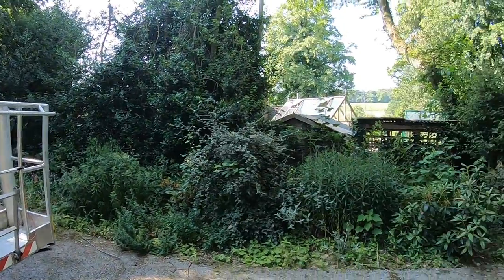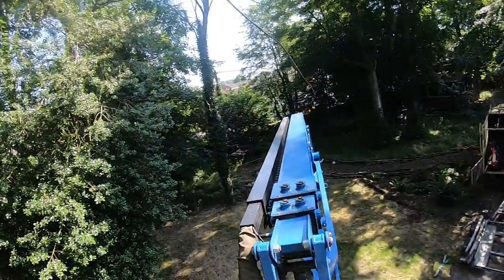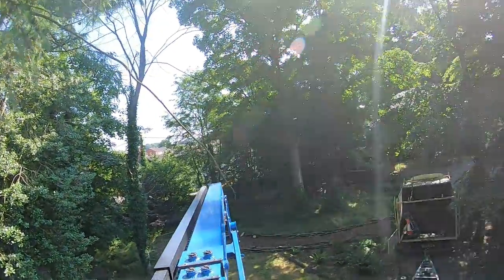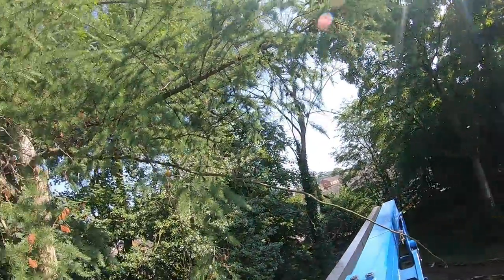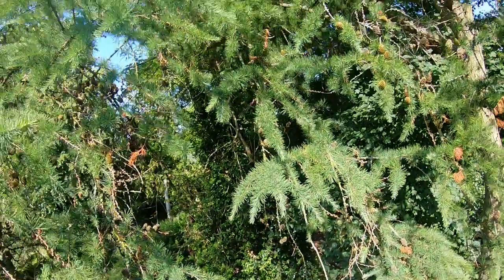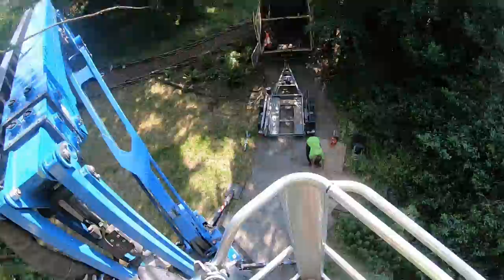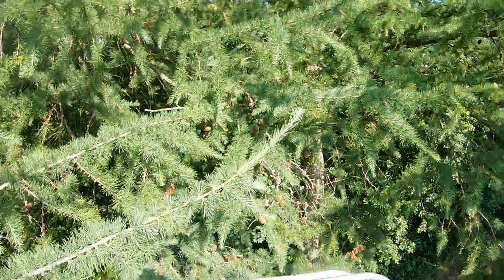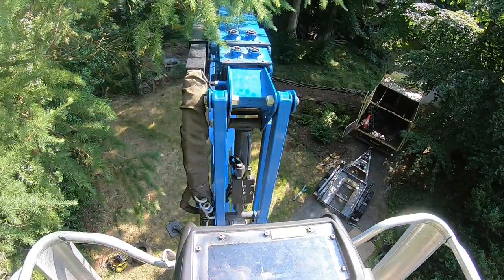Be sweet. So with a MEWP, you want to remember an acronym, LUST. L-U-S-T. That's lower boom, upper boom, slew, and telly out. That's sort of the order you want to be operating the MEWP with. This is the upper boom, lower boom, sorry. You're going to have to slew.